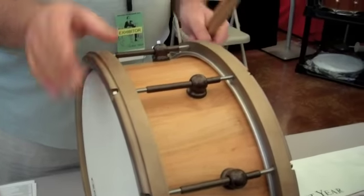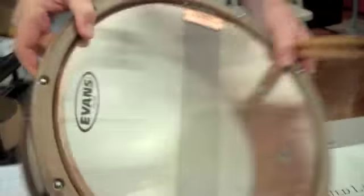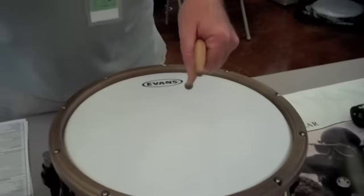You're doing all stave — or block — shell construction. Everything we're doing is stave. I'm a dinosaur; I do it with a router on a threaded rod. Basically I set up a little Lazy Susan — it has a handle that fits in, one motor is my left hand, the other motor is my right hand. I very slowly bring the router up by turning it as I'm turning this. It takes about 25 to 30 minutes to work all the way up, then I set it on the inside and did the same thing.